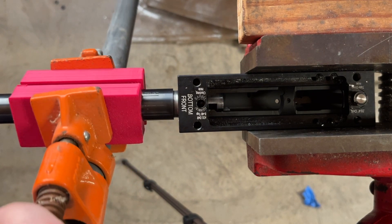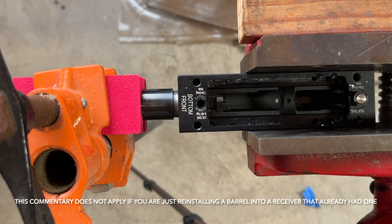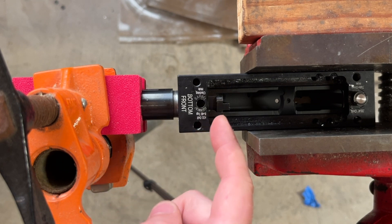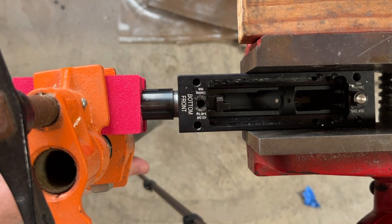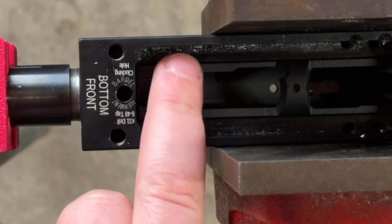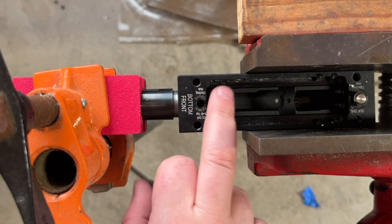A quick reminder: if you're not working with a barrel that has already gone into the receiver, or you haven't seen Episode 2 of this series where I discuss how far a barrel needs to go prior to torquing in order to work with a receiver, go back and watch those things first. Also, you need to have the bottom of the receiver facing upwards so that you can see what's going on. You can see the shelf here in the barrel — when we're done, that needs to be flat with the flat sections on the receiver. Being able to see it from this side is imperative.